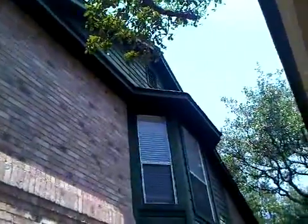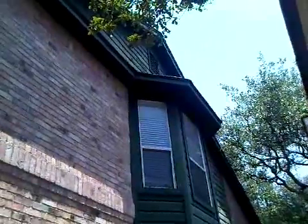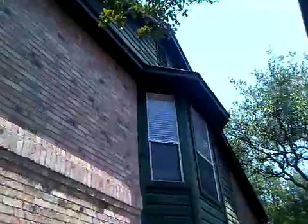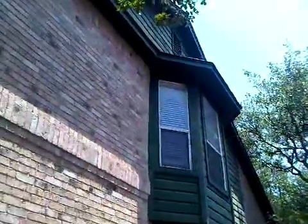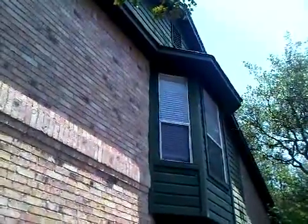That gable up top in real bad shape. It's more than superficial. You can see the siding actually peeling away. It's not just paint, so that would need to be addressed. That would all need to be torn off. Also, all of that sidewall area, we would install 7/16 inch OSB and then come back with our Tyvek and James Hardie siding.